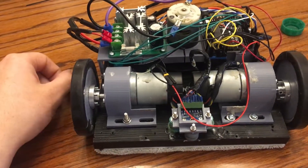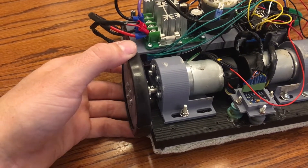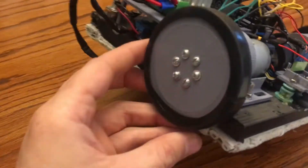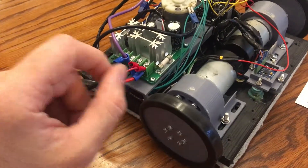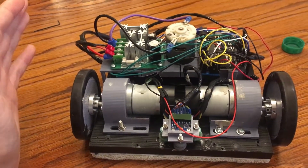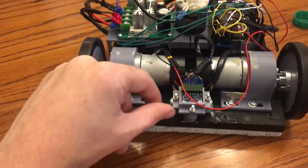The encoders on each motor also help it navigate. For the coefficient of friction — in order to get it to move up the window — I had a hard time finding a material with a really high coefficient of static friction on glass. This is self-adhesive pipe repair tape, a silicone stretchy tape that sticks really well to glass. I just wrapped it around the wheel a couple of times and it sticks quite well, giving the robot enough traction to move up and down the window.